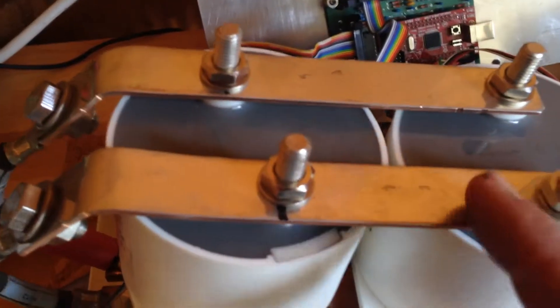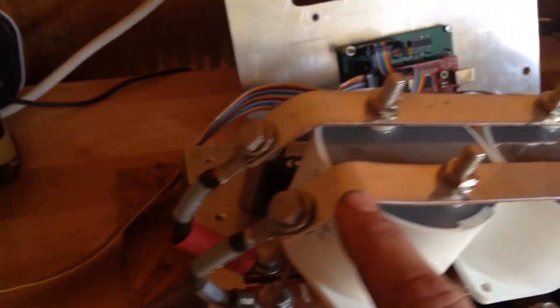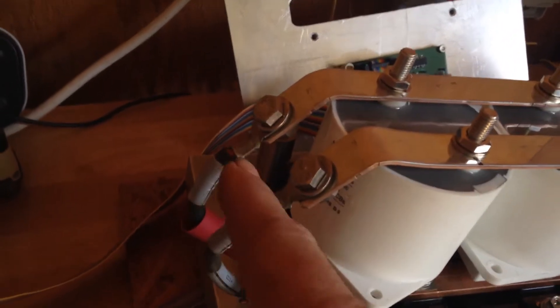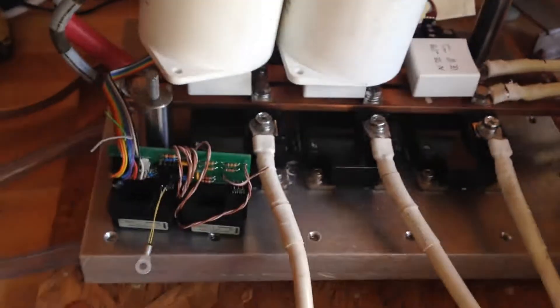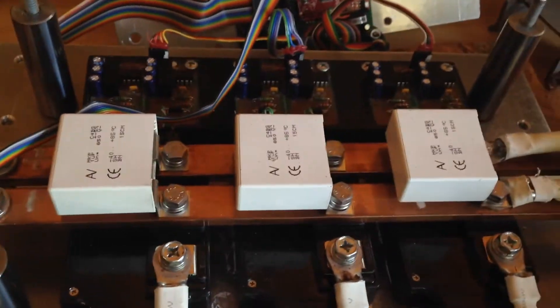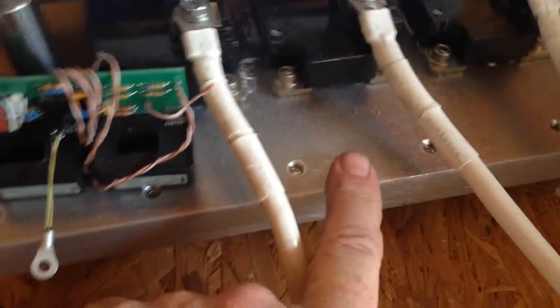So I got some real nickel plated bars that I had for my Nissan Leaf battery pack, and then just put those across, bent them down a little bit, and then put a small wire from positive to positive, and negative to negative, onto the main bus bar that the IGBTs are connected to. There are three snubbers on this thing — he's got a snubber on each one of these IGBTs, the driver boards, and the cooling plate, which I think was done extremely well.